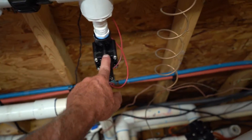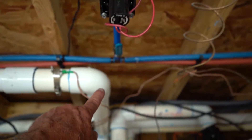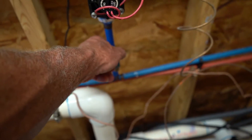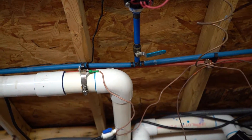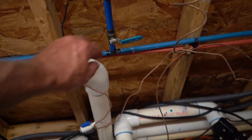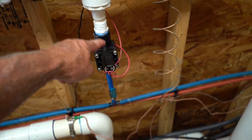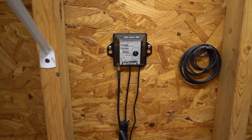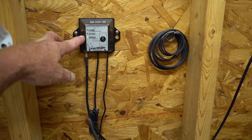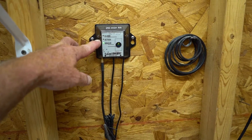This is your autofill system. You saw the autofill sensor in the pool, and this is the actual valve that goes down to the fill line. If you needed to shut it off for some reason, the manual shut off to the fill is simply that valve right there — that would close the water off to prevent filling. Normally you would leave that open. The water goes through this valve, this valve turns on, and then it comes up through here. That is your controller for that valve — it takes its information from the sensor and determines whether it needs to turn that valve on or off.